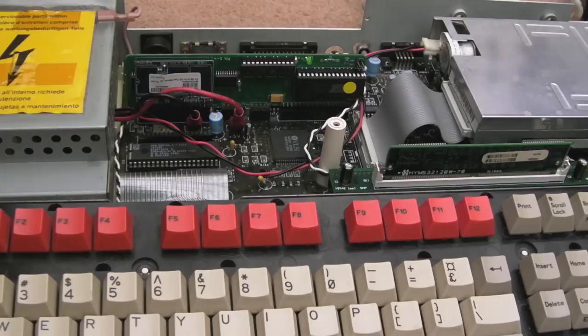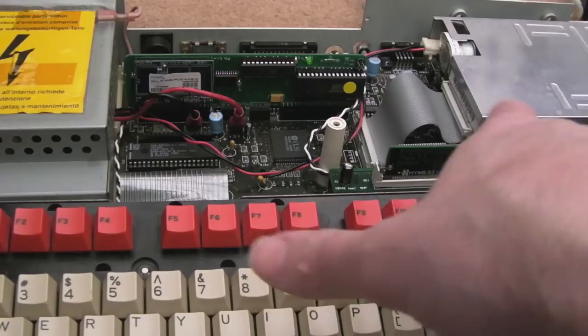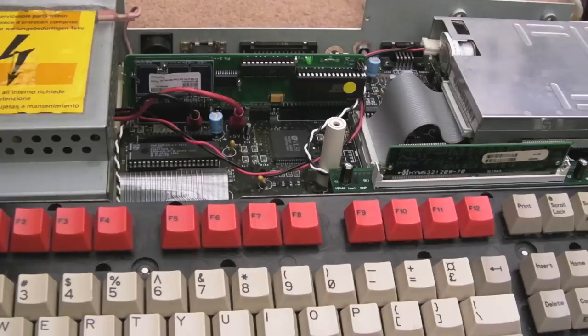So unless there's a board revision, someone must have done a mod. Now, I forget, you'll perhaps remember, but earlier on I had to revert an audio mod on one of these. There were some caps lifted and things like that. I'm wondering if someone cut traces and that was perhaps the other one. This one perhaps is the one that was okay, I'm not sure. I suspect this is the one that had the audio mod and reverted and it's okay. So quite why the other one is quiet, I don't know, but I'm going to need to take the other one back to pieces again and try and work out why the audio is half as loud as this one.